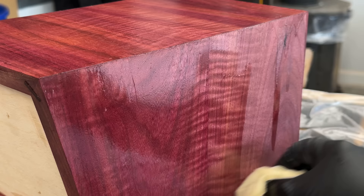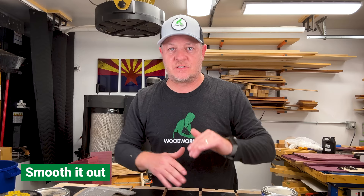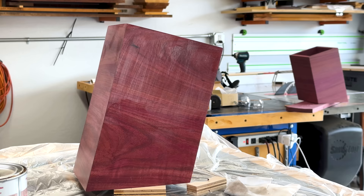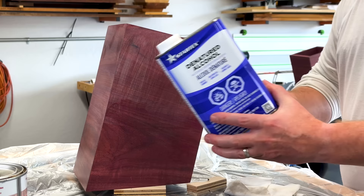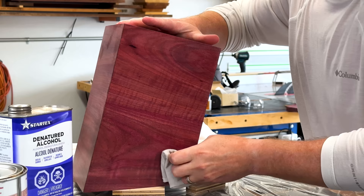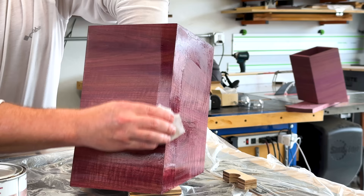When I go to remove the imperfections from a coat of shellac, I'll usually grab one of these synthetic finishing pads. If that's taking too long or I've got streaks that just aren't going to come out with that, I'll grab a rag and denatured alcohol and just rub it down. The denatured alcohol melts the shellac and helps it smooth out really nicely. You're watching me work out the imperfections with a rag, dampened a little bit with denatured alcohol, just removing the imperfections.